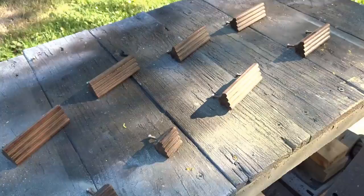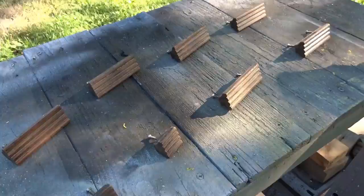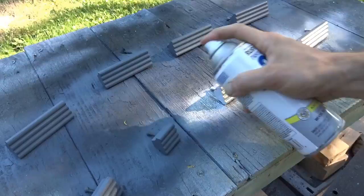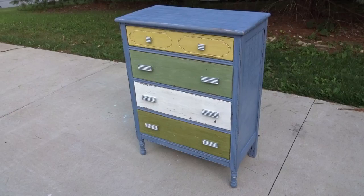The last thing is to go ahead and paint all the handles. I sanded them earlier and I'm going to use some gray primer first to get them coated, then paint them with a metallic aluminum color to add a little bit of a modern touch. Once those dry I'll flip them over, get the other side, and they'll be ready for the metallic aluminum paint. Unlike the other dresser in the last video with chrome spray paint, this is a little more subdued — kind of looks like melted aluminum.